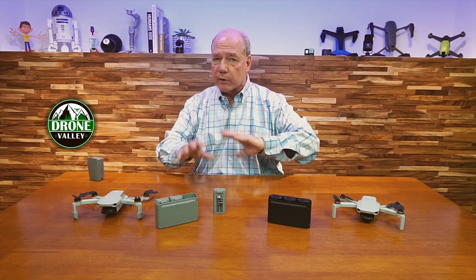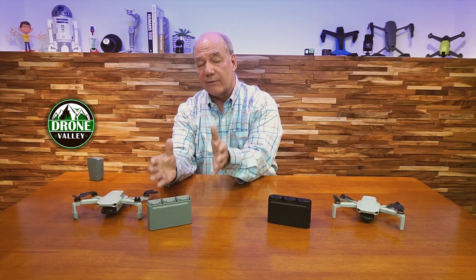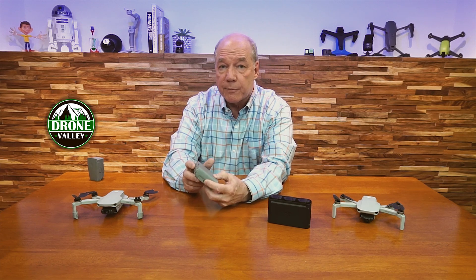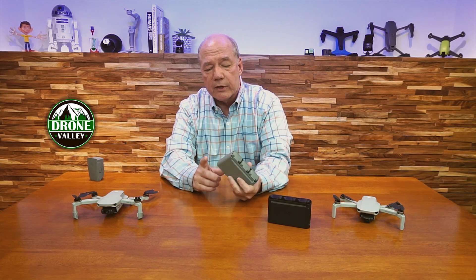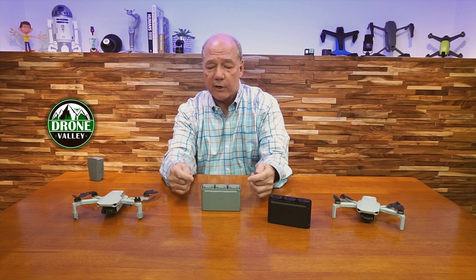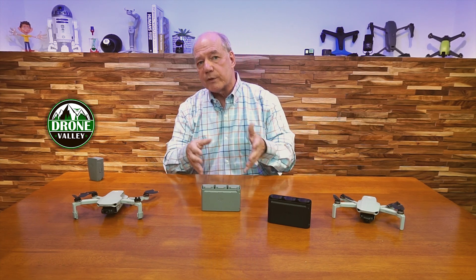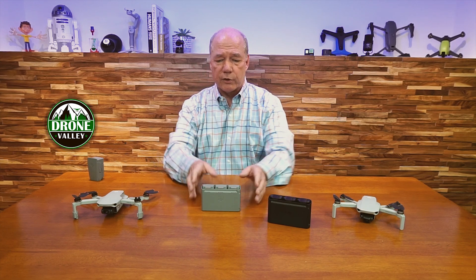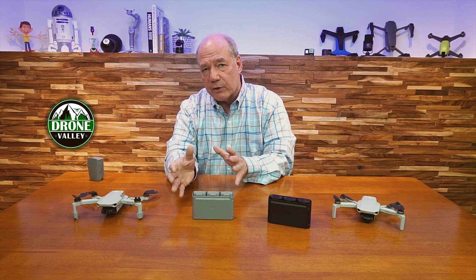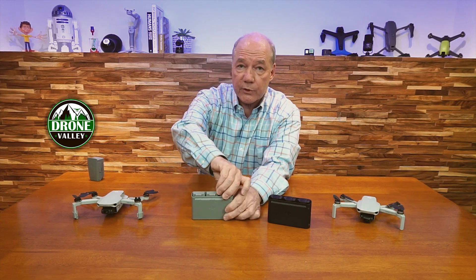With self-contained batteries on pretty much every other DJI drone, the on button is right on the battery. With the Mini 2 it isn't, and there's no separate connection between the button and the controller to say 'you can go to sleep, wake up when I press this.' The communication channel has to stay open. From a programming perspective, it's going to be tricky — if the only connection between battery and drone is those two communication lines, they kind of have to be watching all the time for the drone to wake up.